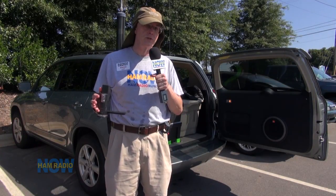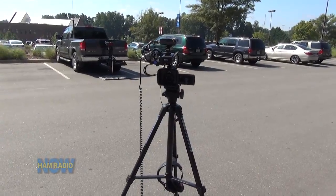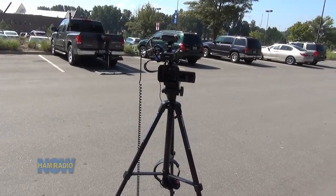In some big markets you can't necessarily find an empty channel — it gets real hard. Here we're well within coverage of the Charlotte area television transmitters, but they're not occupying every channel. Since I move from place to place I could move into the spectrum that a local TV station is using, so I've got to move all the wireless mics off to a new frequency.